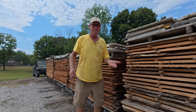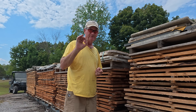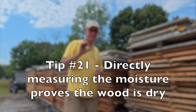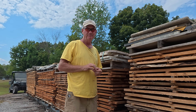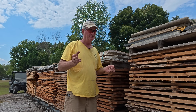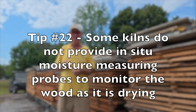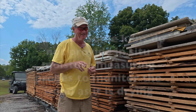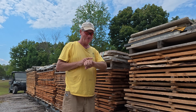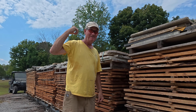These screw right into the pack of wood — you've got two probes per pack. A kiln dries wood, therefore it's important to know the actual moisture content of the wood at any given time. You use a moisture measuring device — there are several out there. You don't buy a kiln that does not directly measure the moisture content of the wood while it's drying. It'll be like going scuba diving and looking at your watch going, 'I've got another 10 minutes of air,' while your air gauge is saying you're empty.